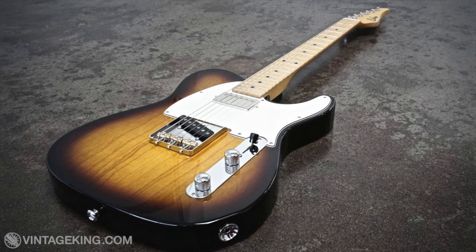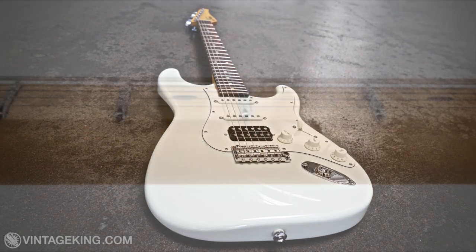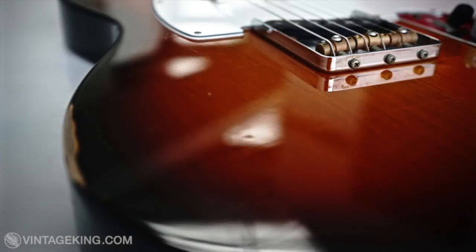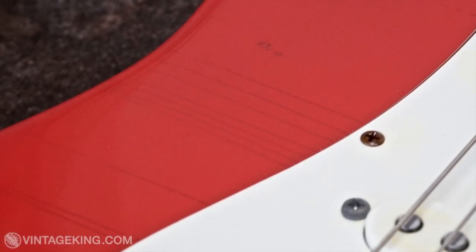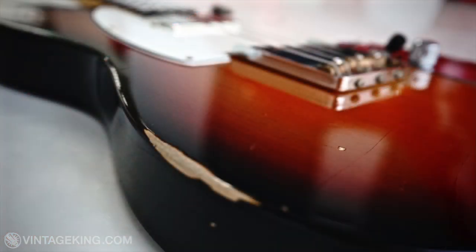The finish on the Pro series guitars is a thin-skin urethane style finish — really durable. On the necks it's a satin urethane finish, untinted, providing a nice natural wood feel while offering excellent protection against moisture. The finish on the Classic Antique models, on both the neck and body, is a true nitrocellulose lacquer finish. The guitars have been carefully aged to appear like instruments that have been well cared for but played a lot over the years. Nitro will continue to age and evolve over the lifespan of the guitar, and these are really for the player who doesn't mind a few scratches and nicks and dings.